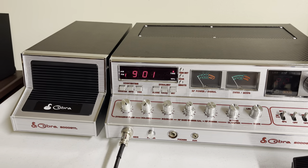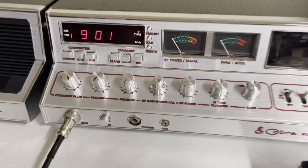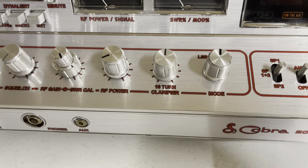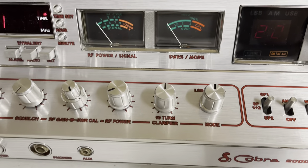The radio has had all the electrolytic capacitors replaced, tuned, and aligned, as you can see here. The tone control is now your RF power. The dual control clarifier has been removed and a 10-turn clarifier installed to make sideband a lot better.